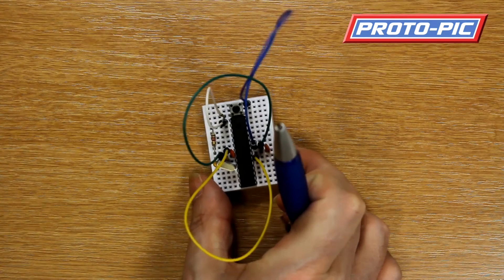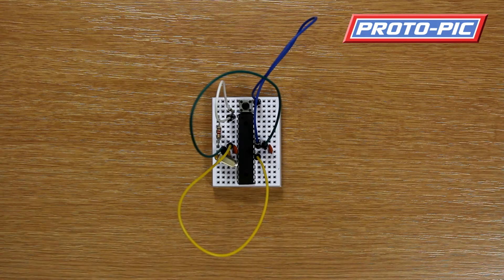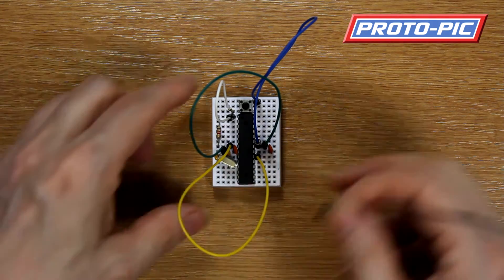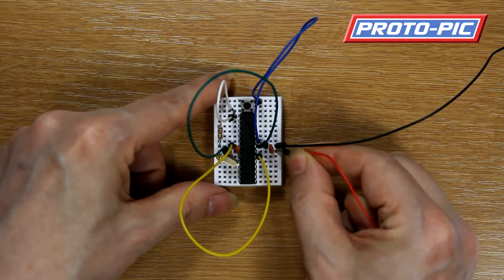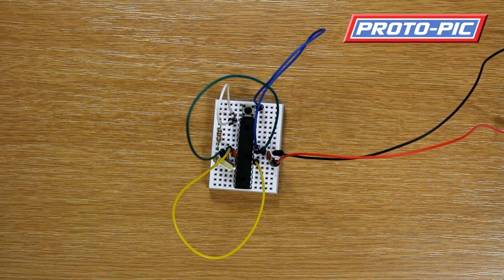To run this Arduino you will need power. I'm just going to use jumper wires as a demonstration — obviously you would connect power to the other end of these cables. What you need is a negative wire that goes to where the blue and green wires are, running off to your negative or ground, and then down to where this wire is by itself, which would be your positive. You would then supply five volts to your board.